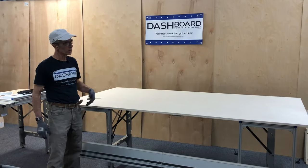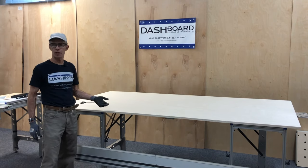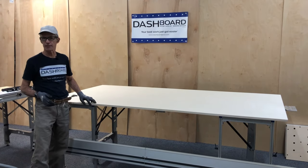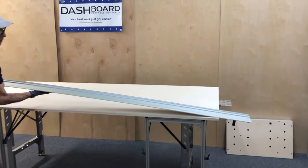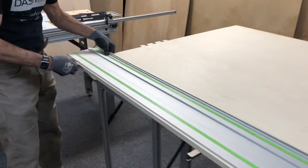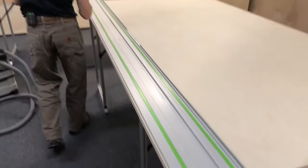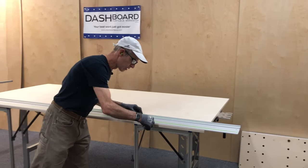It's good practice to rip the factory edge off of your sheets before you start your cuts — it saves a step later so you can go to final width right away, because the factory edge is rough and nasty on pretty much anything you buy. I'm just going to take my rail, leave the spiral dogs on it for later, use a little combination square, take off a short amount and run down the other end to set it again — getting an even amount off of both ends.